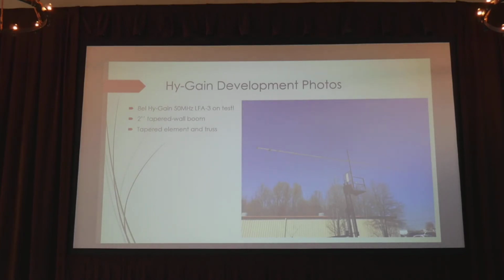It's too early to ask how this compares to the high gain antennas, you know, gain per element number? A little bit better. We all know that gain is associated with boom length, and so per a given foot of boom, he's squeezed just about as much as you can. But the idea here in the third generation is more optimization and better pattern control.